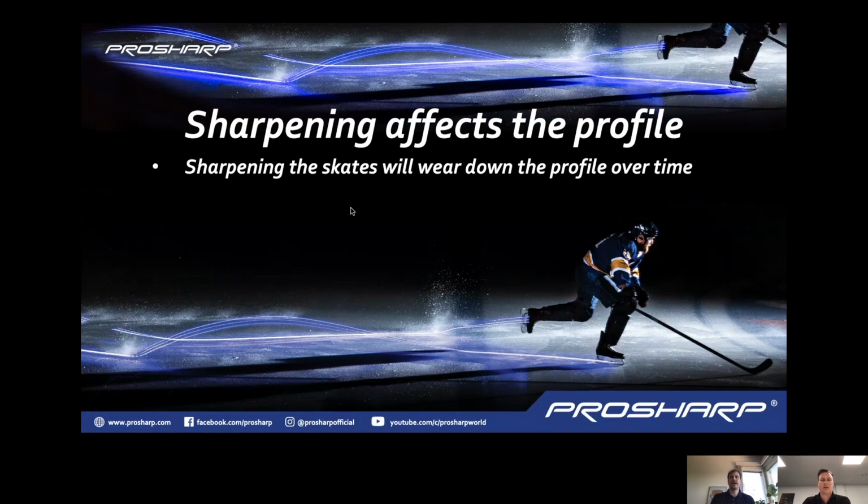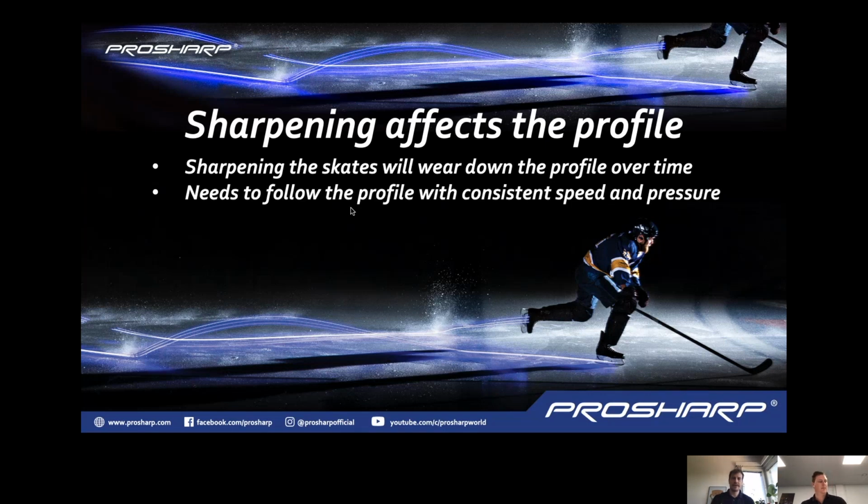Skate sharpening affects the profile. The profile will wear down eventually over time. So that makes it extremely important that when skates are sharpened, you have a consistent speed and a consistent pressure. If you circle back to what we talked about, the small differences, we had an example of a 13-foot radius and a 10-foot radius. The difference is so small that once the skates are sharpened, it's easy to skew them if you don't use an automatic machine that makes sure you have a consistent speed as well as pressure.